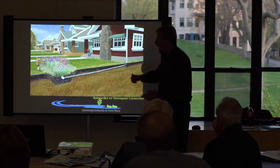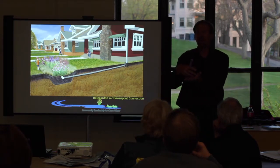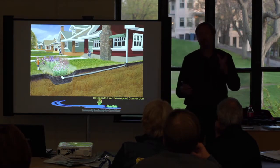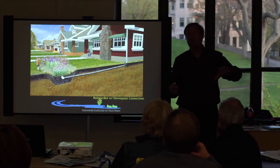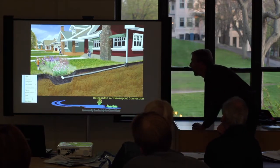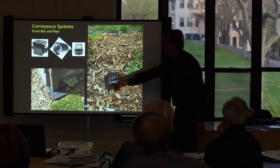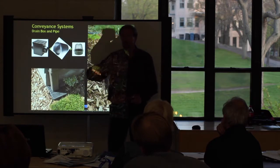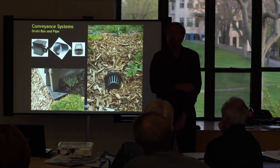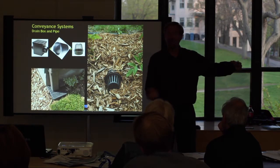Yeah, so the box has a spot for holding debris in it, so I clean that out once in a while. But if it does start to clog, if you get heavy leaf or seeds, maple seeds in there, all you do is take off the cover, put in the garden hose, turn it on full blast, and just push it through and get it out on the other end. You have to take off the chipmunk screen on the other end to get it out.